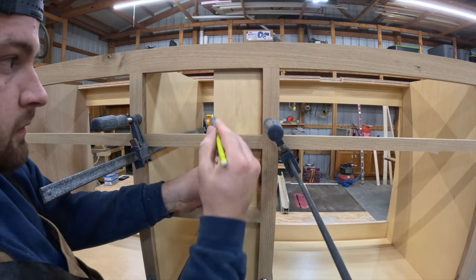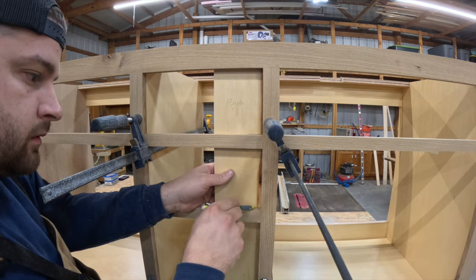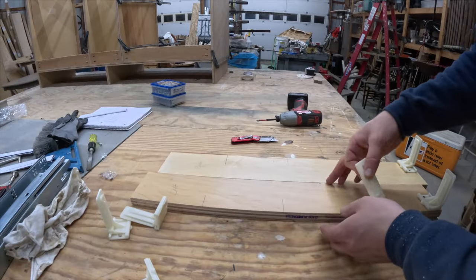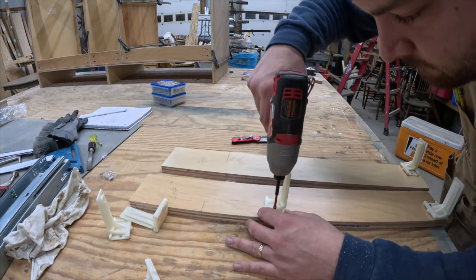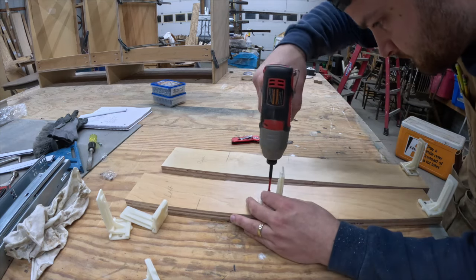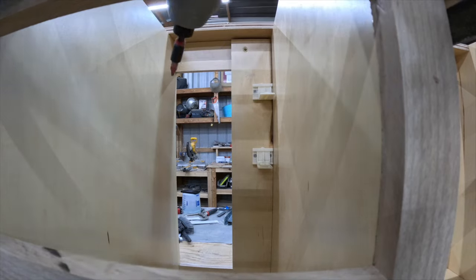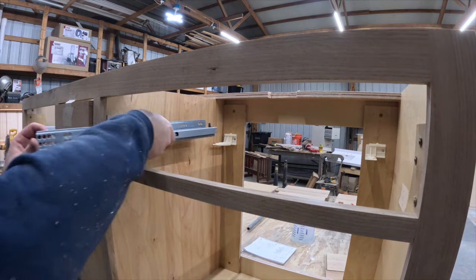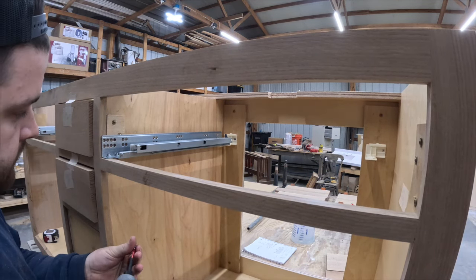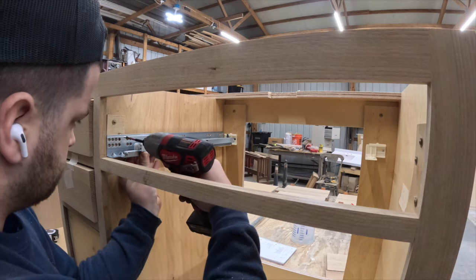I have a separate video coming on how to install these drawer slides so I'm not going to go over every step. I'm using the Nomad soft-close undermount slides off of Amazon. To mount them I take two scrap pieces of plywood and bring them to the front of the face frame, push them up against the side, and mark the corner of the face frame. Then I align the rear bracket mount directly in the corner I marked and screw it into place — repeat for all of the drawers. Once all your back brackets are installed, screw those boards to the back of your cabinet in their respective corners, leaving your mounting brackets perfectly lined up with the face frame when you mount the slides. Then slide the drawer slides into the rear mounting bracket and install them into your cabinet box. I am doing inset face frames, which means my drawer slides connect just behind the face frame and screw to the cabinet box.